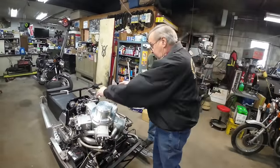So that's the last of the intake system. And then, of course, there's electrical. You've got wires coming from each coil. They don't go to the box; they're triggered from the individual pickups inside here. And then, of course, there's lighting. There's two lighting coils inside that charge the battery. The box down there is for the electric power steering.